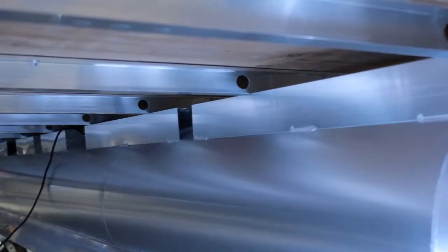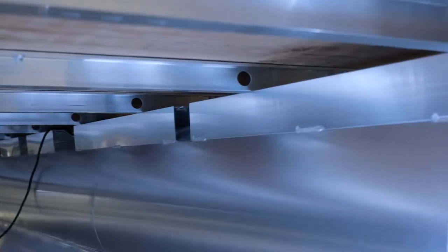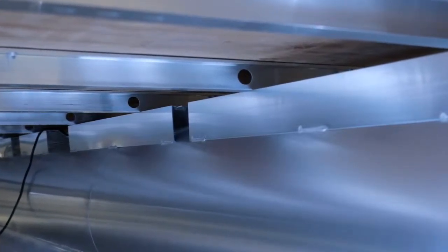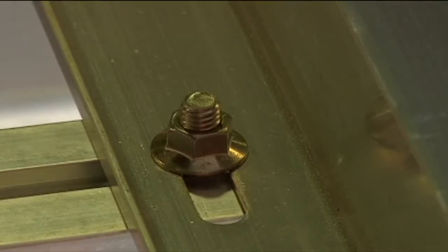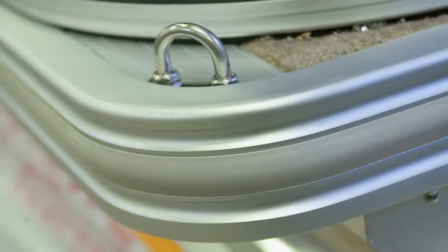Tubes and cross-members are squared to assure that the tubes are parallel to each other and that the structure is square to the tubes. Then the tubes are attached to the cross-members with three-eighths inch carriage bolts and self-locking flange nuts. There is a full C channel at the front and rear of the boat to provide support for bow and rear rub rails in the event of contact at the dock.